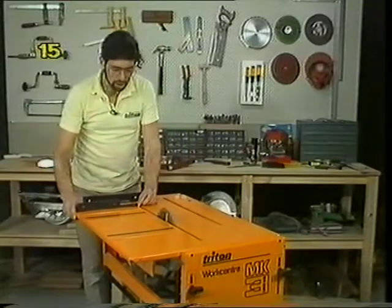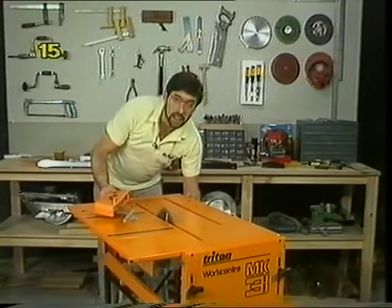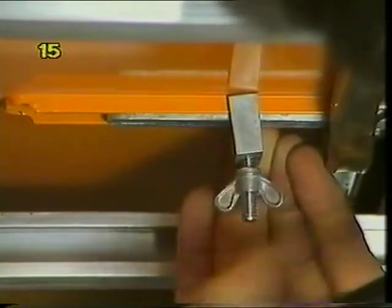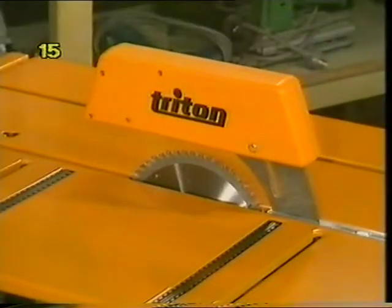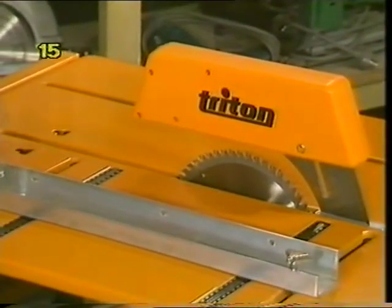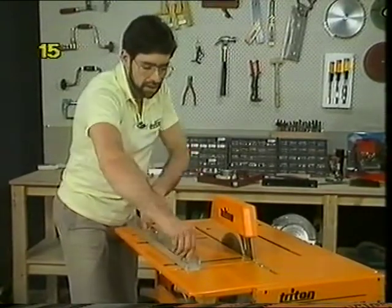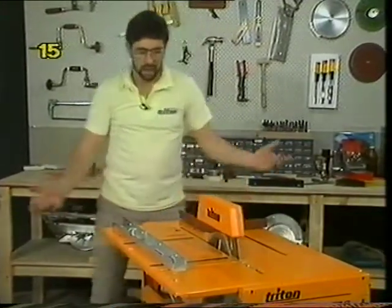Remove the work stops and always double check that the saw chassis is firmly locked by the tab underneath the table. Fit the safety guard and riving knife as close as you can behind the blade — about half an inch or 12 millimetres — and lock that in position. The rip fence goes in with the high side of the fence closest to the blade. Drop it in, turn the feet through 90 degrees, and almost lock them up — still free to adjust and slide but easy to tighten. Then the mitre gauge fits in this slot, and you're ready to go as a table saw.